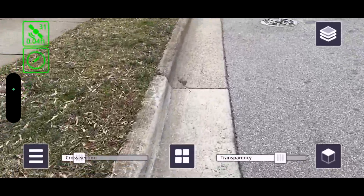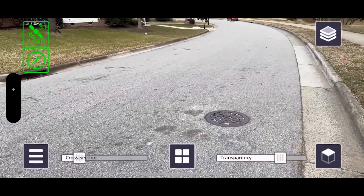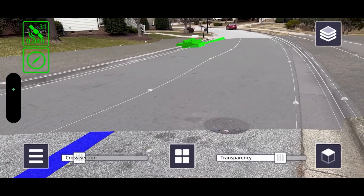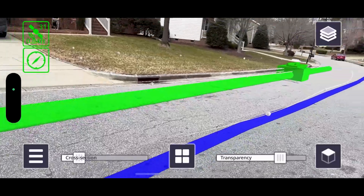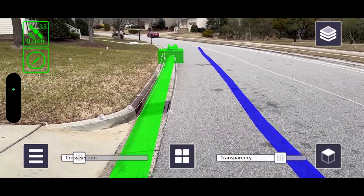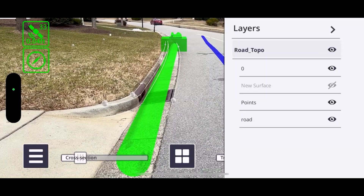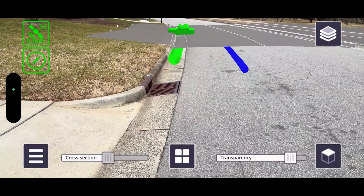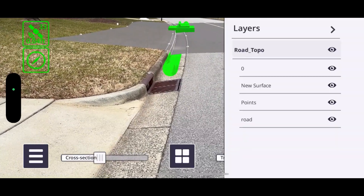Out in the field — you'll see I've got good satellite coverage at the top left, and my heading indicator is green. You do need to walk around a little bit to get a good heading with the device. I'll look at augmented reality first. I open up my layers and turn on this model showing a road surface, a water line, and a storm sewer system. I'll turn off the surface to look at the pipes, and as I walk over to the curb line, you'll see the new storm sewer line lines right up with the curb. I can use the cross-section slider to see the pipe, and a transparency slider to make the model more translucent — giving a good view of how the model fits in real-world space.